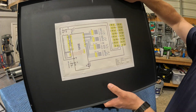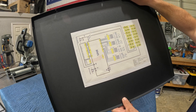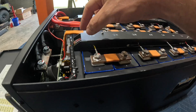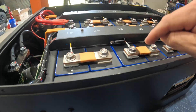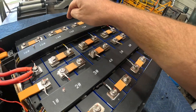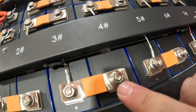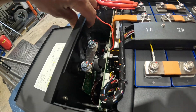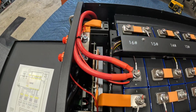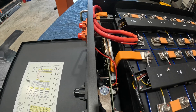Looking at the inside of the case, here's your full battery management system, wiring layout, and some diagrams that may be helpful. All the cells are nicely and neatly stacked. The protective steel wire trays are elevated quite a bit above the cell connections themselves — so if you ever caved in the top, it would contact the steel trays first, not the battery terminals. The terminals appear to have been torqued and marked — those red dots confirm everything's been torqued correctly. Down here is your full battery management system, monitoring temperatures and voltages, keeping the system safe, cutting it off and on as needed.